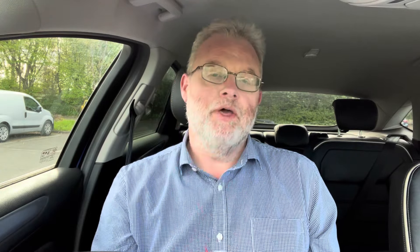For this antenna it's going to be bang on 34 microhenries — could be 32, 33, or 36, something in that ballpark. That figure gives you enough impedance to choke 20 and 10 meters at the coil, so only the section between the transformer and the bottom of the coil is really excited on those bands. Above the coil, the shorter piece of wire operates on 40 meters, because the coil not only chokes 20 and 10 but loads up 40 as well. On 40 meters the antenna is a shortened half-wave — about 55 to 60 percent the length of a typical half-wave on 40 meters.